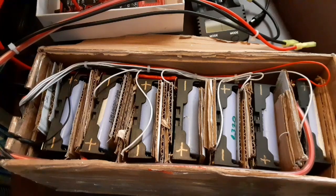What I'm going to do is keep on running them - I'm going to put about four or five more cycles into them, some really good full cycles - and we're going to check and make sure that each one of these little packs is holding about the same amp-hour capacity. When I'm finished with that, I can take all these out of the battery slots and spot weld them together and make a standard-looking battery pack. Then I can move on to the next set of batteries I have from charging these up, though they weren't the greatest batteries, so we'll see what kind of pack we can make out of those.